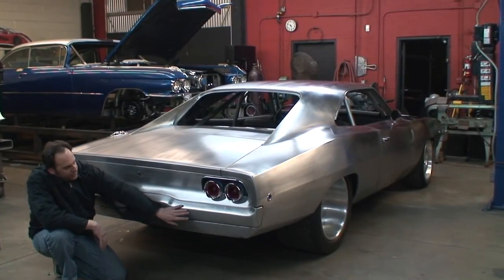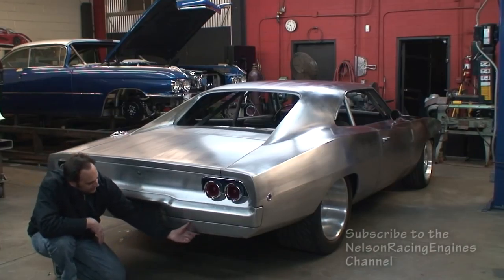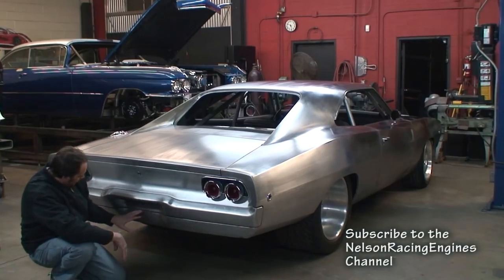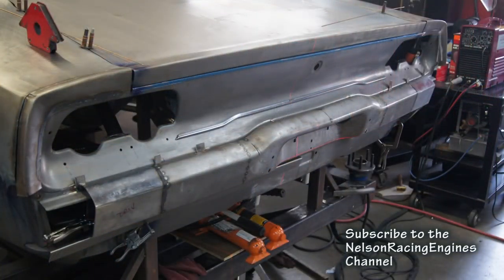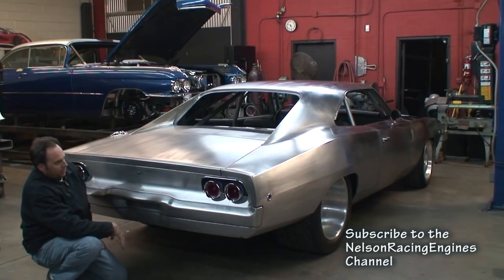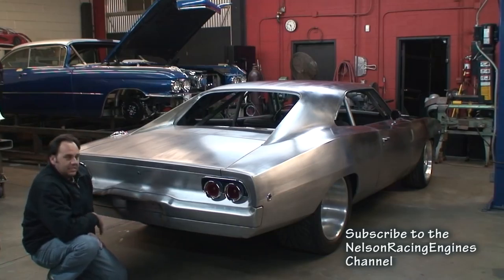The bumper here — you'll notice there are no bumper bolts. All the bumper bolts are gone. This entire lower section has been contoured to the rear bumper for the plate. You can see a section where it was widened — we widened it in multiple places and then metal finished that. So if you look at the rear, it's got a really smooth, nicely gapped finish, but there are tons and tons of hours involved in that.